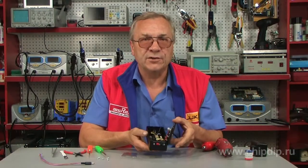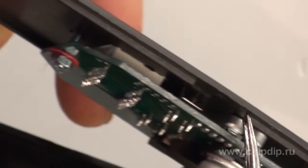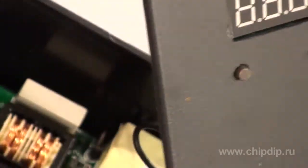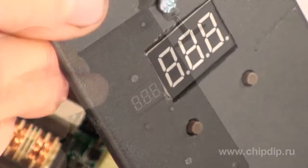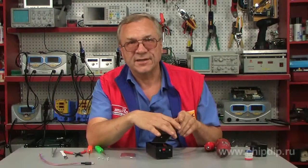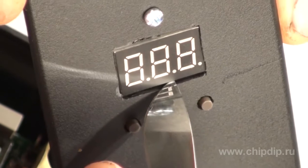Firstly, we put the regulator circuit in a convenient place in the body. I've chosen this body color — it has smaller edges and conveniently matches the markup of the display and control buttons. At first, we drill holes for the buttons. After we put them in the lid, we mark a rectangle to place the display. We use a drill with a cutting disc for this. Try to cut with a smaller margin; the notch can be enlarged with a conventional scalpel, as it cuts soft plastic well.